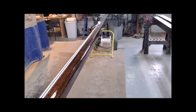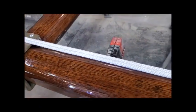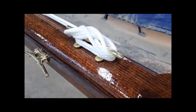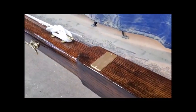If the cleat is down — in other words, the pole rotated 180 degrees — then the yard arm just sits on its mounting pin, but you do have to get your four screws from the bottom, kneeling down under it. So your consideration on whether the pole drops into the mounting base with the cleat up or reversed at 180 with the cleat on the bottom will depend on which side you want the cleat on when the pole is vertical.